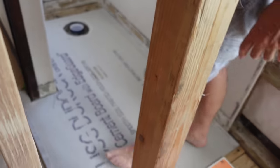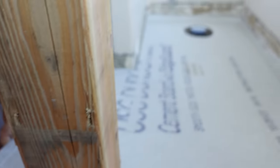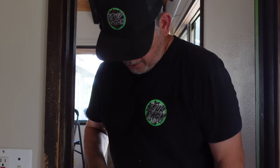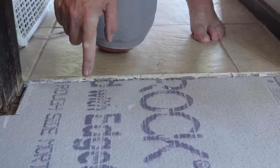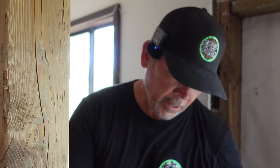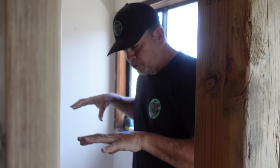All three pieces of our backer board are cut. We've got a seam in the plywood right here — I didn't want my seam in the backer board over that one, so we overlapped it. You'll also notice we used half-inch backer board. Typically I would use quarter-inch on the floors and save the half-inch for the walls, but under the existing tile in this bathroom is half-inch backer board, so we did the same thing here — our tile floor will flush out with the tile in the existing part of the house. Rad's going downstairs to mix up some unmodified thinset. We're going to put the pan down, put it under the backer board, screw all the backer board down, and then we're almost ready for tile on the floors.